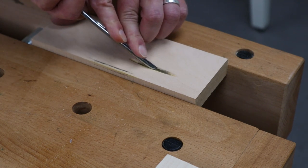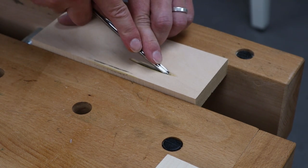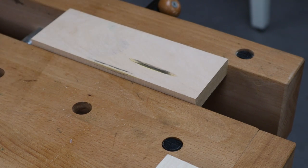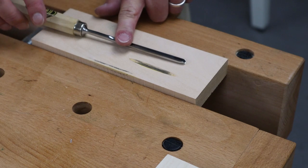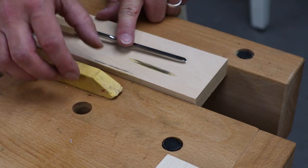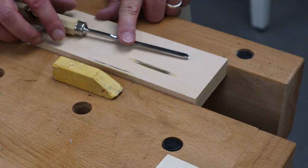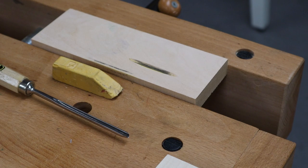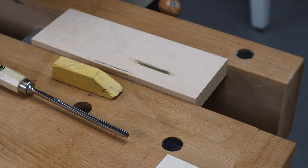And this is a really nice way. You want to do it fairly early on, while your gouges and chisels are all nice and sharp, to cut the shape of the gouge, and then use your honing paste to apply in there. And that's going to work with all these tools as well. If you've got something with a much more open, gentle sweep,